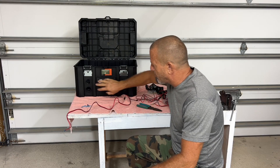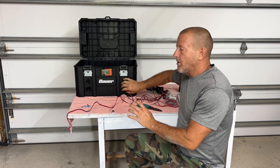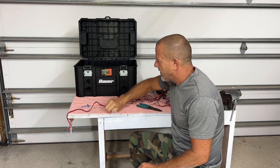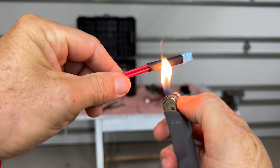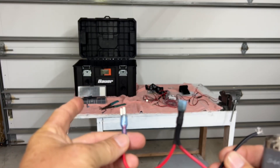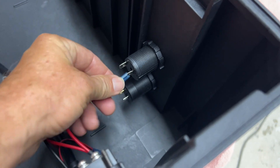What we need to do now is wire the 12-volt circuit. We're going to wire two separate circuits. This cigarette lighter outlet and this USB port are going to run on the same circuit, and then these are going to run on the same circuit. We have plenty of spaces on that six-space fuse block. So we need to create a little pigtail here — a little shrink wrap on that and tighten everything up. Let's make it look good. We have our positive pigtail, and we're going to do the same thing with the negative. Let's go ahead and plug these in to our outlets. Make sure you get your positive on the positive. We've run these in parallel.